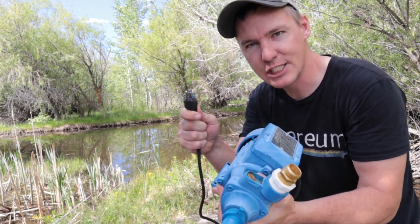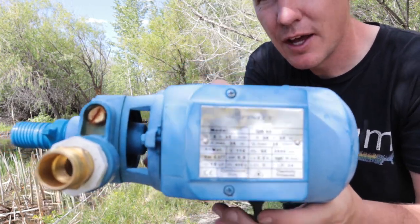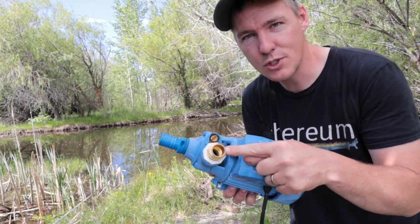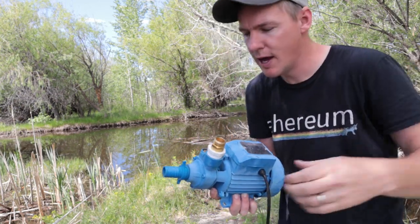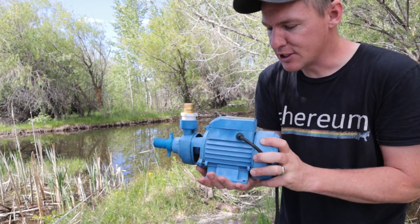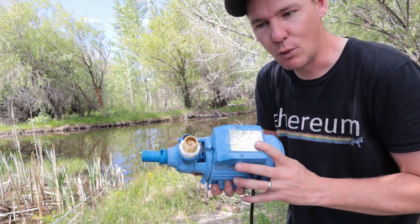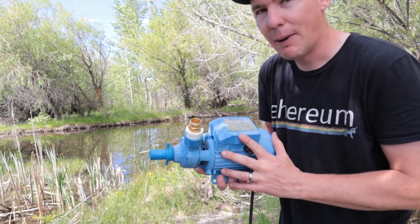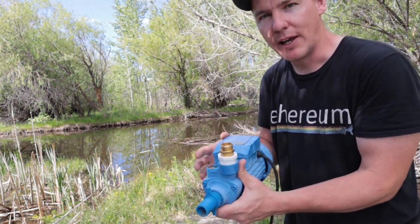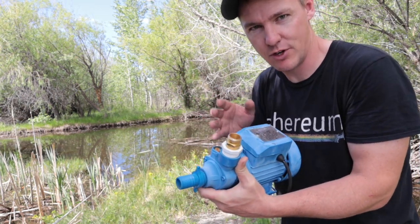This is a 120-volt AC pump, so it just plugs into grid power. The nice thing about this is it's designed to run continuous — 24/7 if I wanted it to, if I could get enough power. I had a hose on the outside and a bigger hose on the inlet with a filter on the end. After a season of using this, something went wrong and it doesn't work anymore. What I liked is that it was really powerful, but it used quite a bit of power and was also very, very loud. And what I didn't like is that I had to prime it — I'd have to get water into it first in order for it to start pumping. It wouldn't suck water up out of the pond initially.